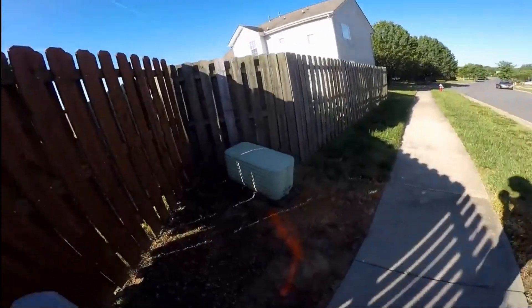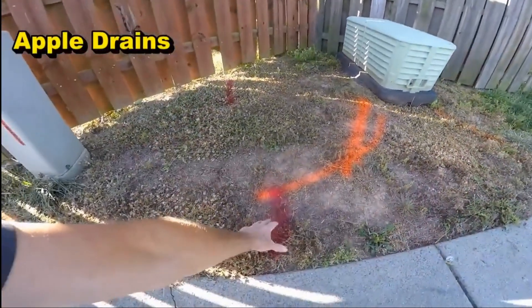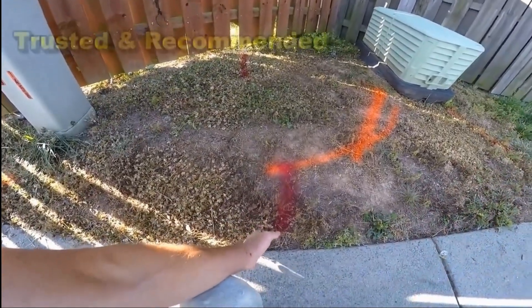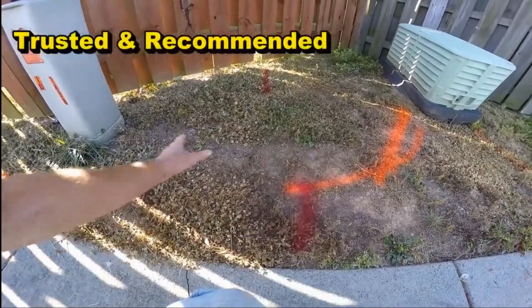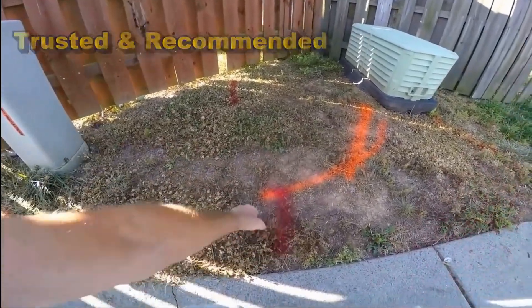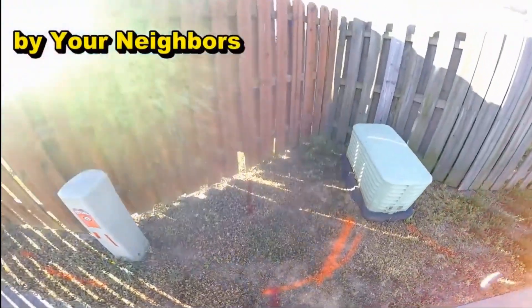The hardest part about this job — two things. If you're doing it yourself, make sure that you mark your area. You can see we're going to discharge right here with a pop-up. We've got the telephone and cable, we've got the power. These telephone lines, the orange lines, are not very deep, so we've got to be really careful.